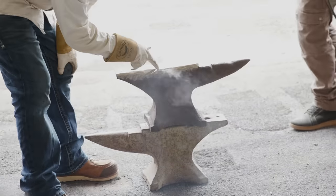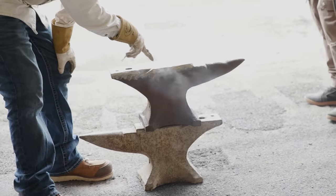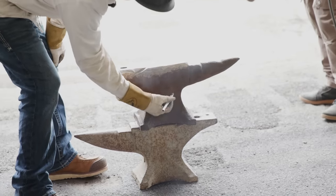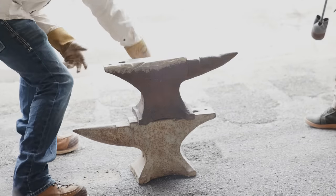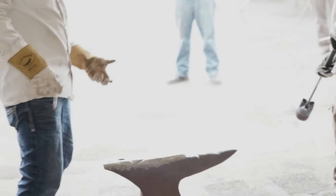So we see now that it's starting to smoke, okay? That's a good indication that we're getting up to 300 degrees, but we only got a 300 degree temp stick. We got to be at least 350. That's good. Down here, that body, you see how it's going clear? We got 300 degrees right there. But we need to be about 350. I want to see it smoke off.